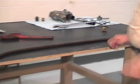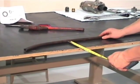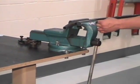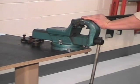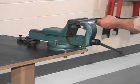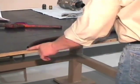After the initial bending, we will need to go back and check if the bend is close. A simple method is to place the pipe against a straight edge and measure to about 5 inches. It is clear that we have about 2-1/2 inches more to go — we are still a bit off. We are working toward 5 inches, and the bend starts at the 28-inch mark.